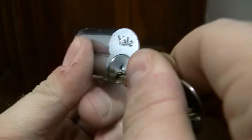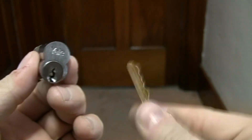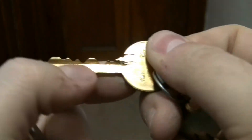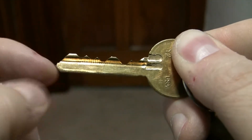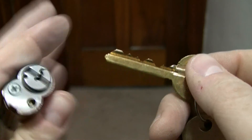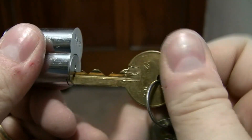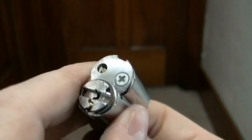Let's show you how this works. Regular key — see it turning the plug. I don't have a lot to show on this because I don't have the housing to put it in. Here is your control key — somebody custom made this, they cut it back to make this key longer. Plus it's also pinned differently. This is not an authentic control key; somebody actually milled this down so it would work. It works this little tab on the back — it's like a Schlage. And this is all that's holding the core in place. Not real sophisticated.